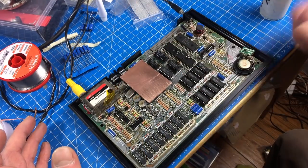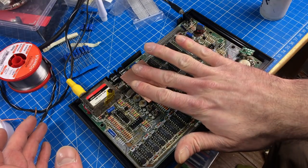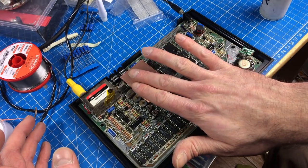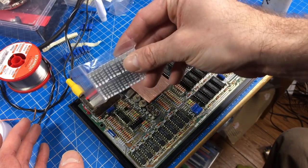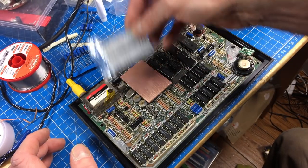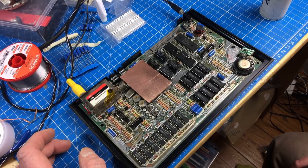This is something you can basically do to all old ICs that get warm - put something on there to spread the heat around. You can put a metal plate, or use adhesive-backed heatsinks, or salvage heatsinks from other electronics. It definitely keeps a bit of stress away from these chips, which will probably let them live a bit longer.